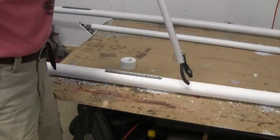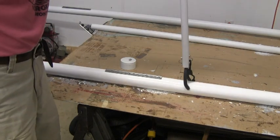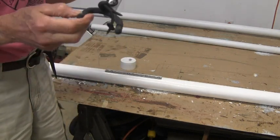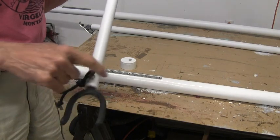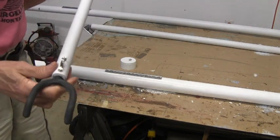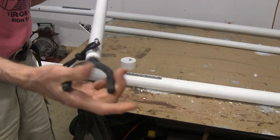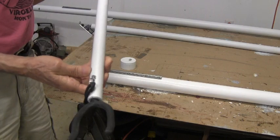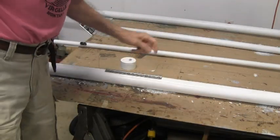The only thing I have to do is make up a new yoke. This one here for the two-inch fits fine, but this other one I'm going to have to make a little bit bigger. I think I can get another one of these and reshape it — it's metal under the rubber coating. They're not that expensive, so hopefully I'll be able to bend it without breaking it. If not, there's some U-bolts and I can get a little lag bolt and weld them up on my welder, or have a friend with a TIG or MIG welder do it for me. Then I can dip them in some liquid plastic handle coating. It'll be a while before I get around to flying this mast.